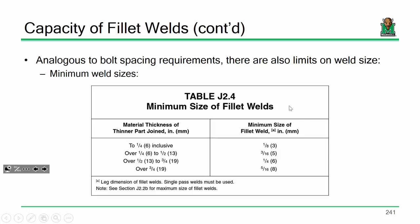For welded connections, we have minimum and maximum weld sizes. Minimum weld sizes exist because of the heat sink effect. If you've got something like an eight-inch thick plate and you're trying to place a bead of weld that's only a quarter of an inch, that super thick plate is going to act like a heat sink, and you're not going to get the weld penetration needed to fully develop that joint — you're going to get a very brittle joint and not an effective weld.